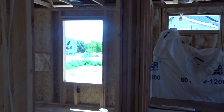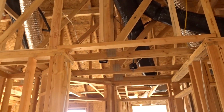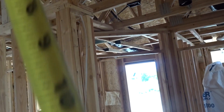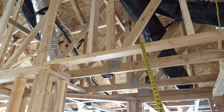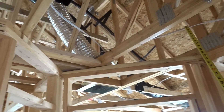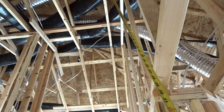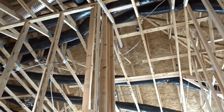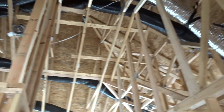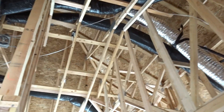The next place you need a smoke detector is if an elevation changes over three feet - and we do have that here. You can see the ceiling here - I'll get my tape measure out and show you. This is all one ceiling height in this hallway, and then you come out of the hall right here and it goes way up to the next level, up to the stairs where there's a bonus room. Since that's over three feet from that little hallway on up to the top, you have to have another smoke detector.